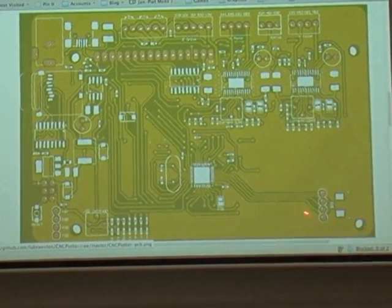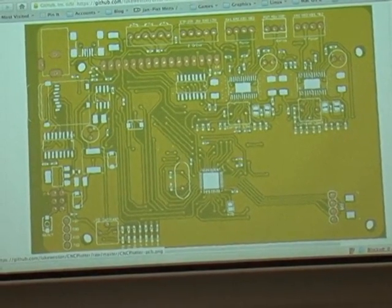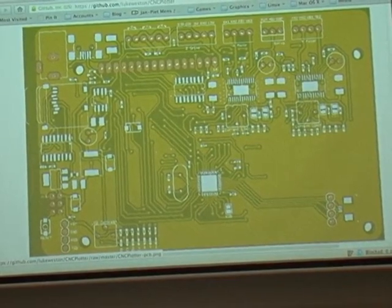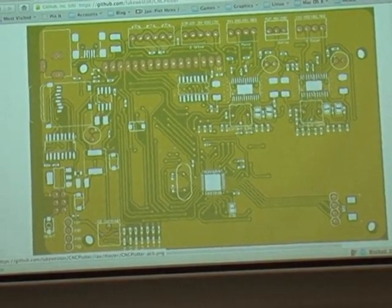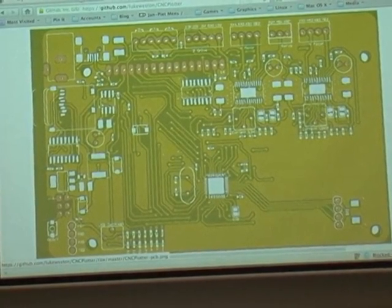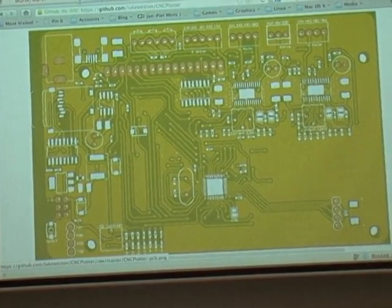So next to it, there's just a set of pads, 4 pins, standard 0.1 inch pitch, so you can solder in a standard header or wires or whatever. That can be used if you want to modify the touchscreen cable or extend it or break it out and hack it in some way. Since they go to the micro, you could also use them as GPIOs. You could hack them to do other stuff, but not using it as a touchscreen. They just go straight into the micro.